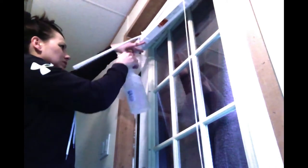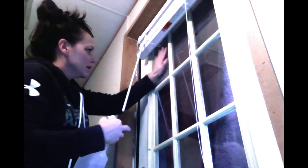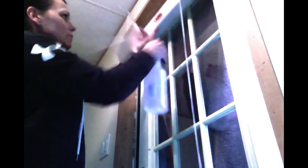And a bottle of water — I got this spray bottle for 97 cents, and this is going to save me a lot more than 97 cents throughout the winter. So what you do first is spray the water, and then with the bubble side pointing towards you, make the bubble side point toward the side you want to keep the heat in. Wherever you want your heat, that's where your bubbles go, and the flat surface on the other side.